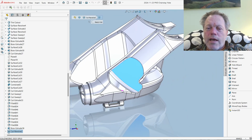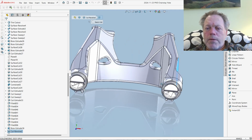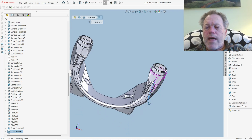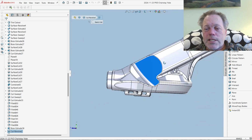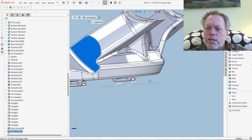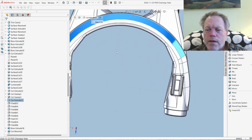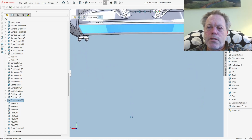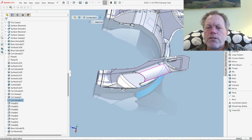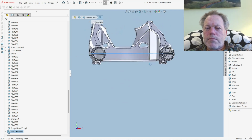But if you notice cross-sectionally, I have a huge area there by doing this drop stay and crossover. It's an extremely rigid structure. If you look at the bottom, there's a lot of support for that side of the stay. If you've ever done flimsy stays, you know how bad it can get. This is a huge amount of clearance. I've also got bike clearance with this lower chamfer, and it goes all the way around, which is really cool. It's adding more clearance. I've got my routing there with the 2 different diameters because brake hose and derailleur hose are different. Fairly narrow support. That's cool. I've gone down to just a single internal support like that, just to make your I-beam.